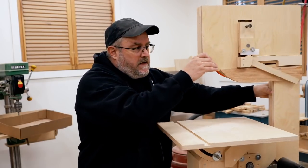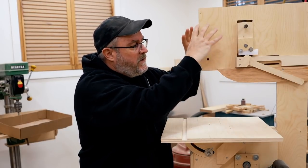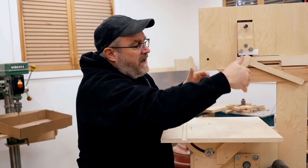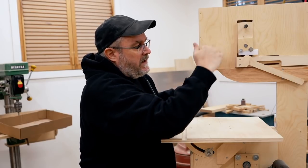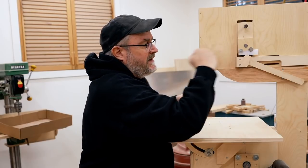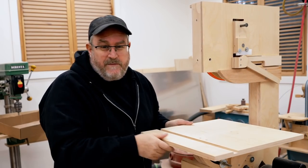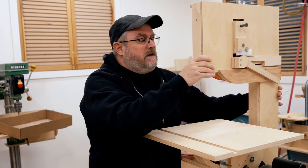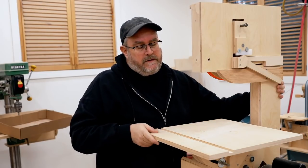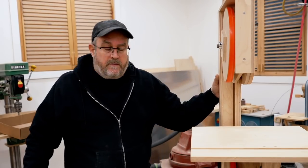All this stuff being cut out here takes a lot of the strength away from this panel, and also the strength axis of the plywood is actually going the wrong way. Ideally it should be going this way, when in fact it's going this way. For Baltic Birch it doesn't matter that much, but it makes a difference. Adding those two parts really stiffened it up and made the problem so that it's no longer really a problem.